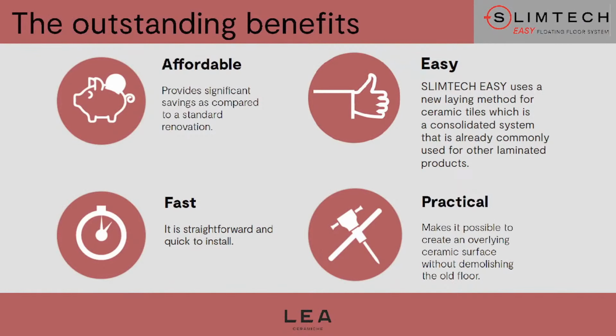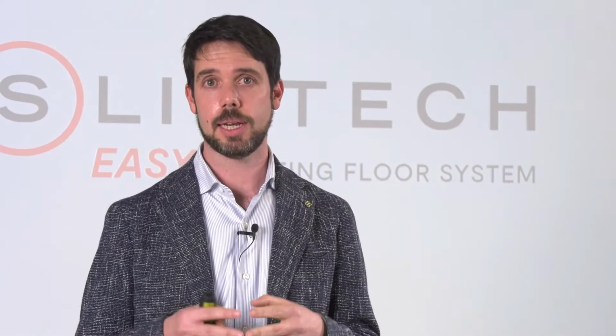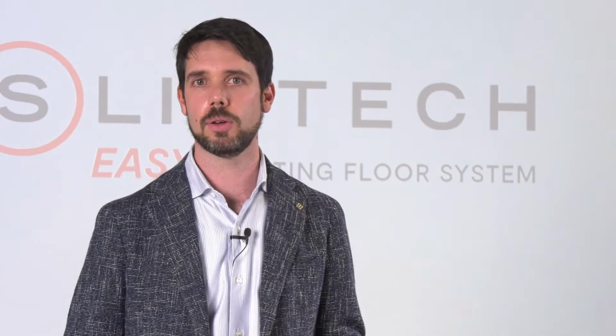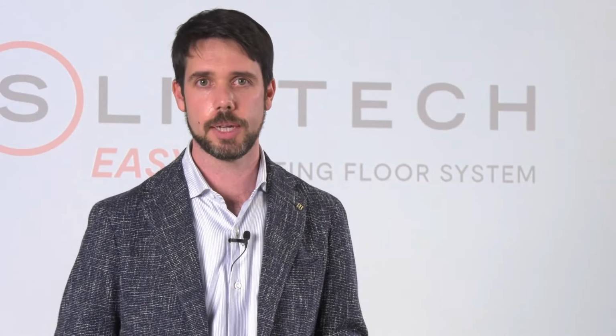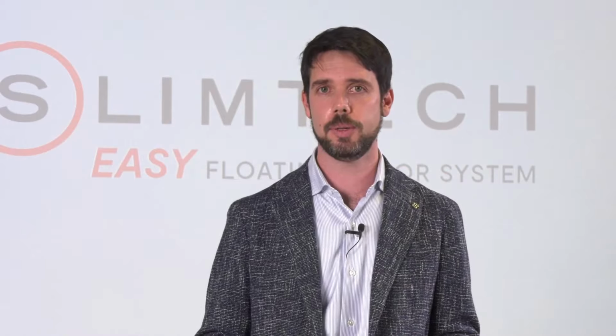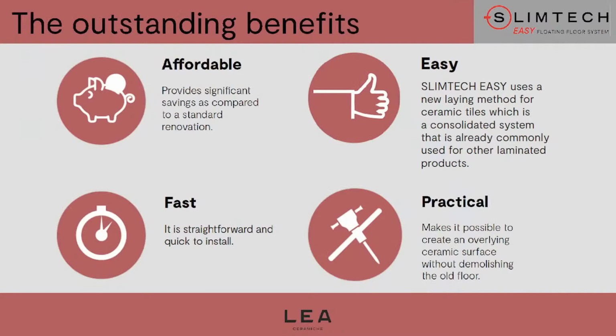because laying is much quicker. On average, laying time is reduced by 40%. And on top of this, the commissioning is virtually zeroed. Because, of course, the ripening of glue and grout requires 14 days, while in the case of Silent, we have no glue at all, and the curing of the Silent only requires about 10 hours, to be really precise. But after 1 hour, we can say that the film at the top is virtually dry. So also the commissioning times are reduced to 0.